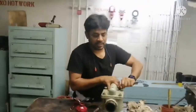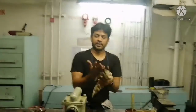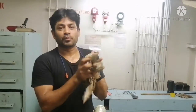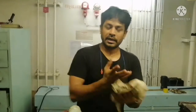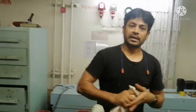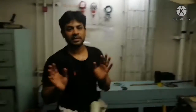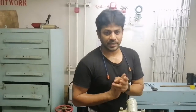Whenever we are overhauling our gear pump, always check the condition of your bush. Always check the condition of your driving shaft and the casing condition. If the clearance is more, please check the maker's recommendation for clearances — if it is more than specified, then we have to change it. Change your driving gear or your entire casing. I believe this video must have given you some information about how to overhaul the gear pump which is attached to your purifier.